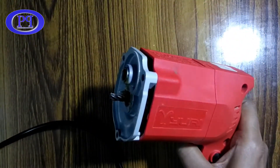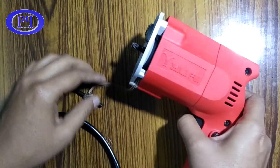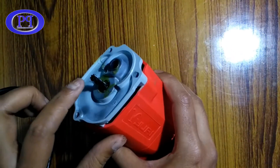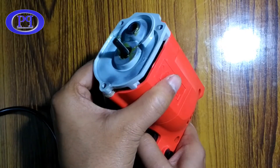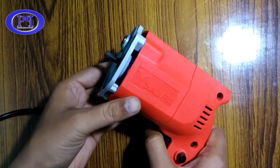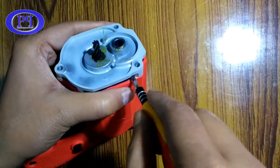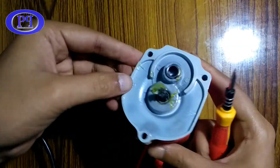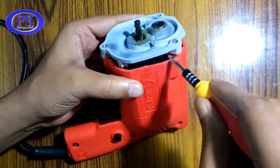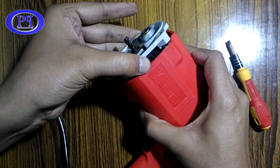This is the only wheel available inside and it is getting rotated with this spiral shaft, which has spiral grooves on it. Let's turn it on — it is rotating very freely because there is no load on it. I removed the load so it's rotating freely, which increases the RPM. Once the load is fixed, the RPM will be less. Anyway, this drill machine is good for drilling into wall, wood, iron, or concrete — the rest depends on the drill bits.